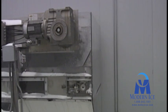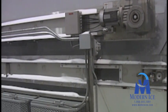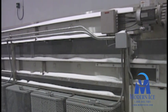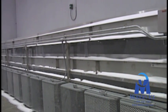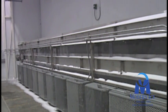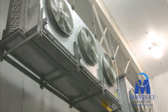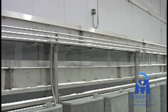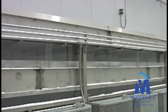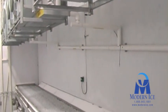The ice is exposed not only to very cold temperatures, but extremely windy conditions as well, causing a wind chill factor which additionally assists in the drying process. The high air flow is achieved with multiple evaporators blowing from above and fans mounted underneath the belt creating a swirling wind within the drying room. All moisture has been completely removed by the time the ice leaves the drying room.